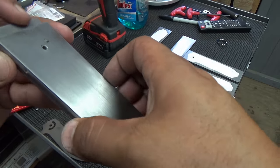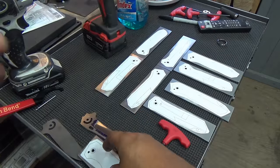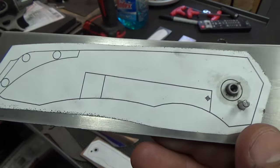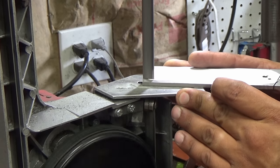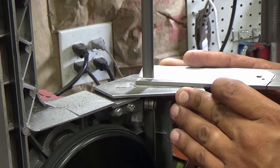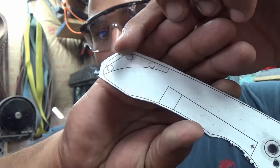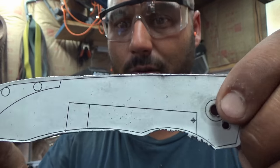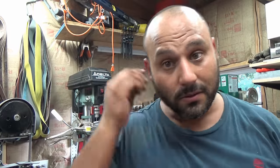So we're going to find a happy middle ground and clamp them together. But first, we're not going to clamp these two big pieces together. First what we have to do is take this back apart and we're going to cut these out on the bandsaw now, and leave ourselves a little bit of room on the outside — something like that, with a little bit of room for the backspacer — and now we're going to go and grind this out.